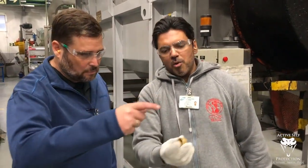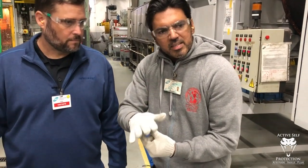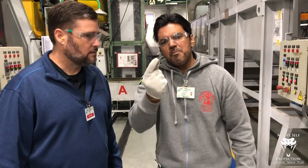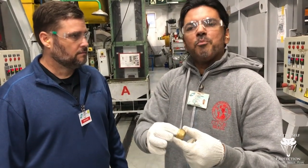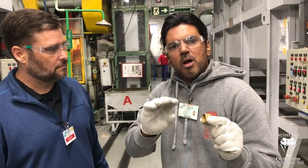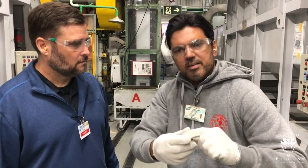After that, the double stroke plug turns it into basically a big chunk, plug it in there, and then anneal it. We cut at this, and after that, we draw the cup. And then we have the cup for 0.50, ready to be annealed. This cup is already annealed. This is just the first annealing process. After that, we have more: second, third process of drawing and annealing. And then we have the case, ready to be tapered.